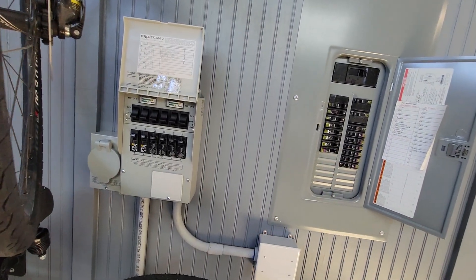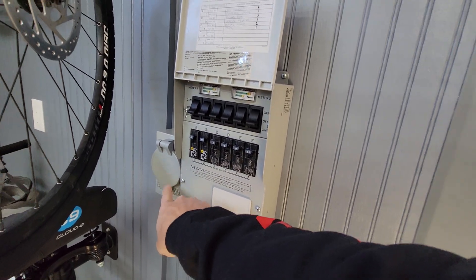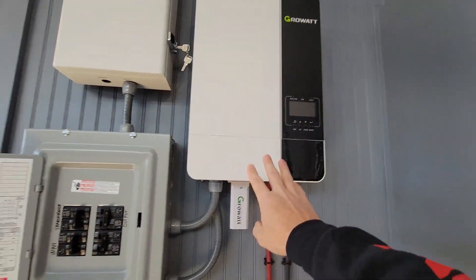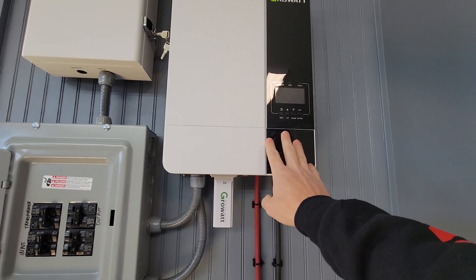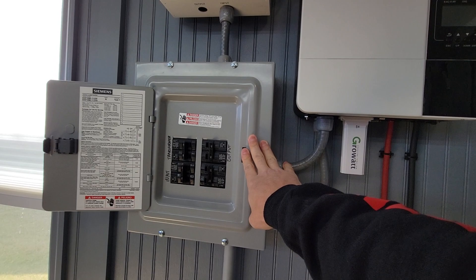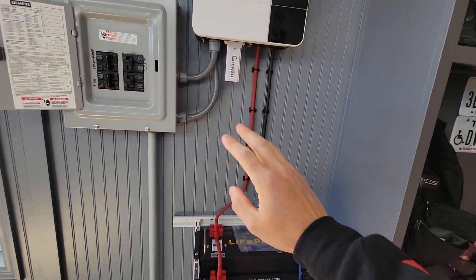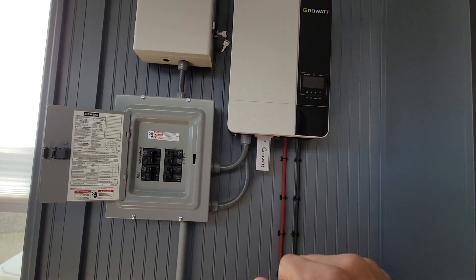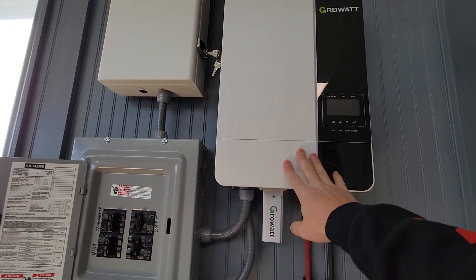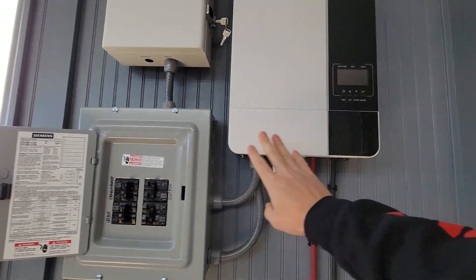This 240-volt plug here is not actually powering this box — it's actually for my generator. I plug the generator in here and it back-feeds power all the way over to the inverter. Once the generator is on, the inverter will do two things: it will start sending power to the batteries to charge them, and it will also take over the electrical demand of the house. Right now I have it set to 15 amps to charge the batteries, which is kind of excessive given that the max amperage output my generator can accommodate is 15 amps, so in a power outage I'd need to change that to a lower amperage to leave some energy left over to power the outlets.